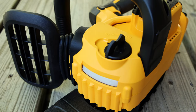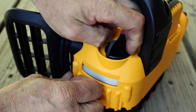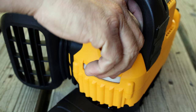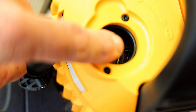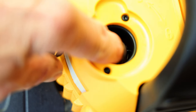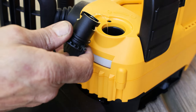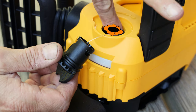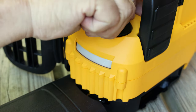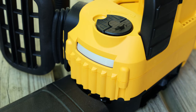Is this some kind of a joke oil cap? That thing's freaking tight. Okay, there it goes. And you can see right there beyond my fingertip is that little point sticking out. That point is so you fill the oil up until it just contacts it. And very similar to water displacement, this thing utilizes oil displacement technology. So if you fill it up past that pin, it's gonna cause it to overflow. And you just turn it clockwise about a quarter turn and snap the lock down.